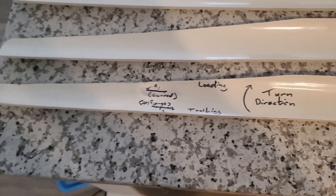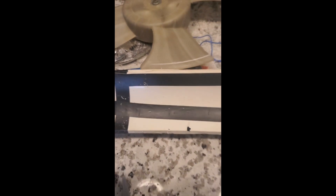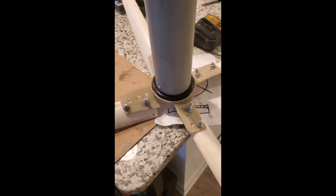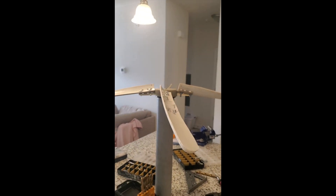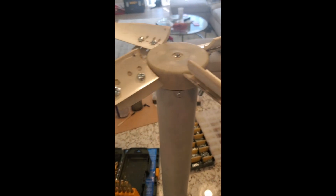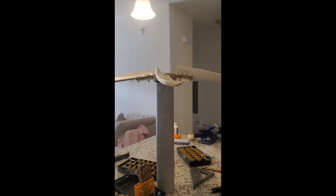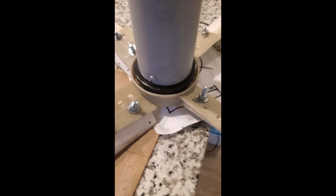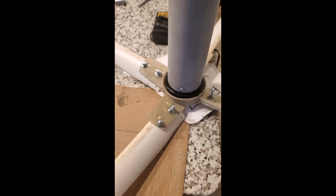Another improvement was making the blades more tapered towards the ends — my initial blades didn't have enough width removed. I also used a better angle; looking at the equations in one of the links, I realized a shallower angle would be better. And purely by accident, you want the angle to decrease even further the further you get from the hub. When I made my blades there's a slight twist in them — that's just how they came out — which happened to be the right twist. Also, it only needs two bolts, not three, and I realigned the holes to change the angle.